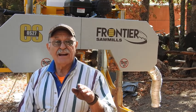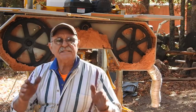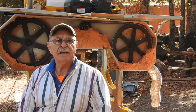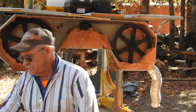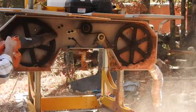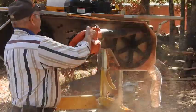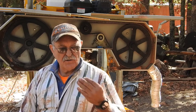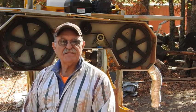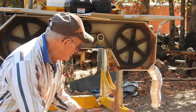That's just something else to keep in mind. On that big stuff when it was 21 inches wide, every two passes I had to stop and clean it out. It literally plugged up the sawdust chute — just such a great quantity of that moist sawdust, it just created heck. That's the way I like to clean them out — take a small brush and get in there and get all the nooks and crannies that the blower just doesn't want to get to because it's so wet and stuck. I also blow it all out around the rails so it doesn't sit there with all that moisture and cause deterioration.